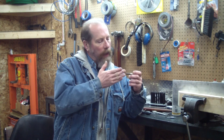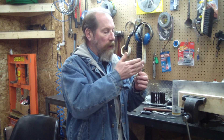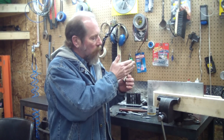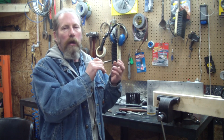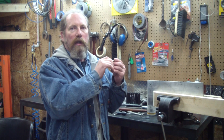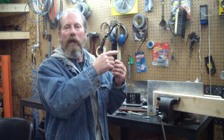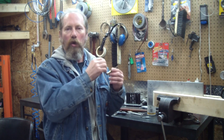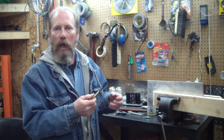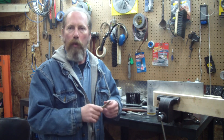Take your cutoff wheel and grind a groove right down the center of the bolt, making a trough. Then file it so you've got a flat edge in the direction it's going to be turning — the edge that's going to be screwing in, going to the right, is going to be flat. As you're going in there, there's nowhere else for the metal to go. If you get a couple threads started and it gets into the area where the threads are bad, it's going to take it along for a ride around the groove and dump into that trough you've made. Use tons of lubricant and it will clean up those threads. You can get that thing done and be on your merry way — just with one wasted bolt. You're better off getting a brand new bolt for that job. Hope that helps you out.